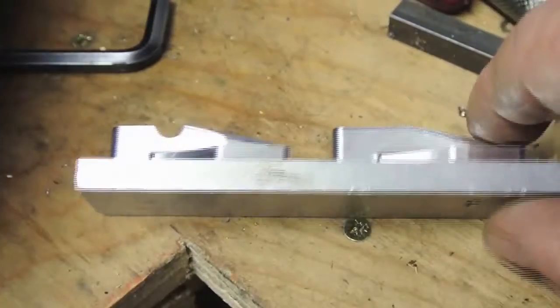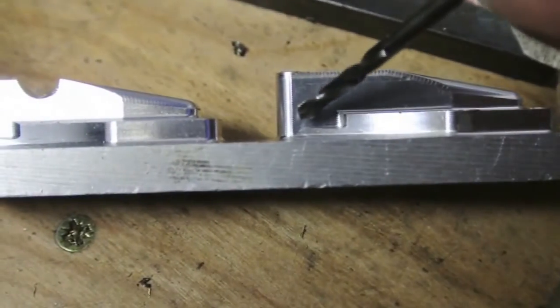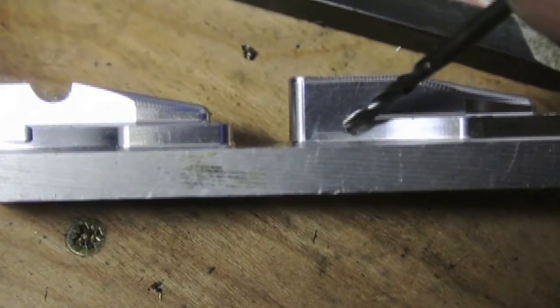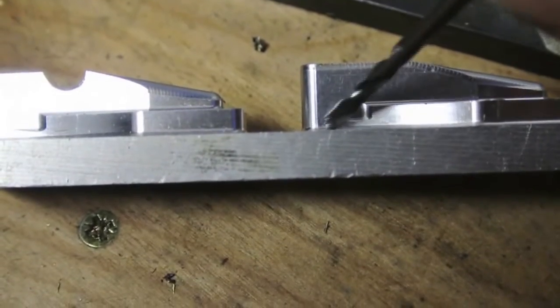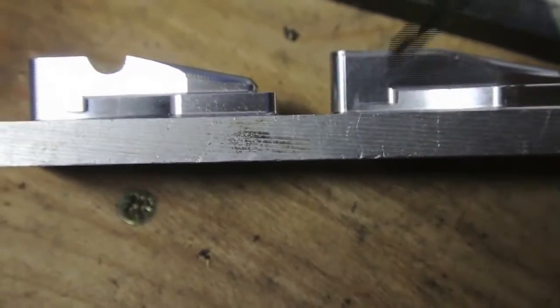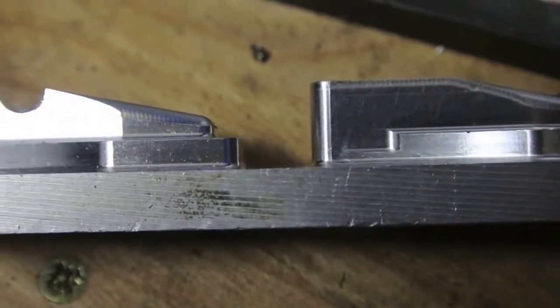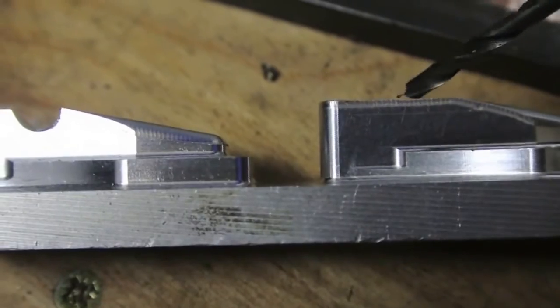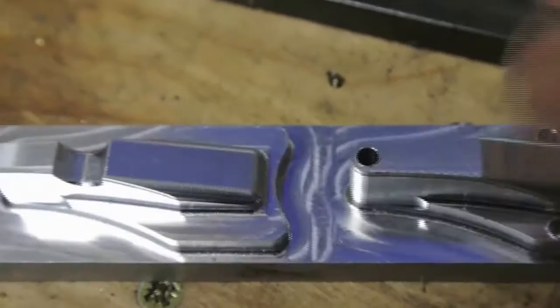Well, these are the truck components. I'll just point out the gouge — some problem with the program anyway. If you see here, this part here has been gouged out. This smooth radius here should blend with the end radius. And also along the top edge there's a slight bit of interference from the end mill that did the rounding of the corners. So that was a problem with that one.